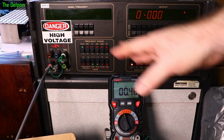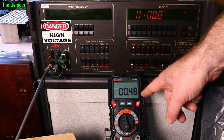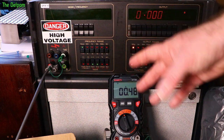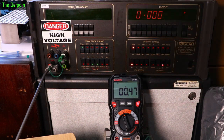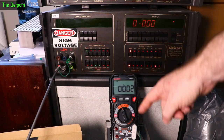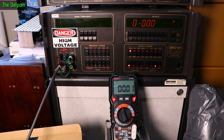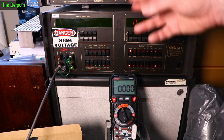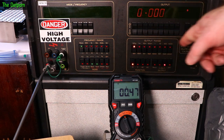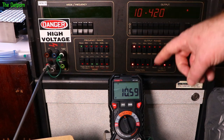Let's check out resistance now. At 0Ω — effectively a short — we're seeing 0.48. That could be lead resistance and input circuitry of the calibrator. Putting a short directly on the meter: resistance reads essentially zero — fine. That 0.4Ω is just cables and input circuitry with two-wire measurement. Working up through the ranges: full scale of the lowest range reads about right.